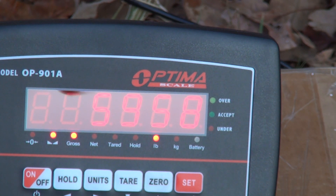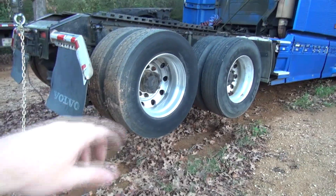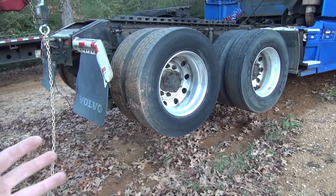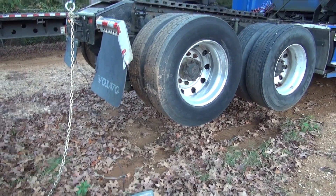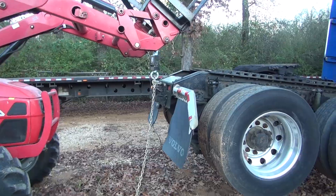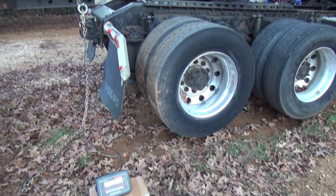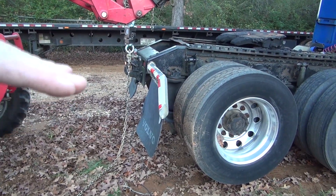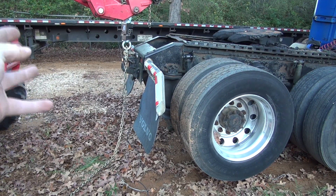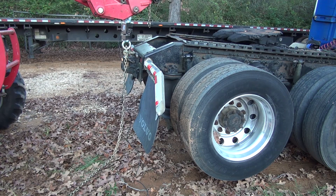5,960 pounds — and that's got the truck way up off the ground. This truck does not have any fuel in the tanks, otherwise we'd be getting a bigger number or we wouldn't be picking it up at all, because that's about all the tractor's got there. That's well over five feet right there. So we're looking at just over 6,000 pounds. I let it down some closer to the ground and it gets lighter — just like when you're picking up a wheelbarrow, the higher you can pick it up, the easier it gets. But your loader gets less able to pick up the higher you go, so there are forces fighting each other. It's over 6,000 pounds right there on the load scale.